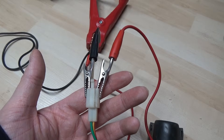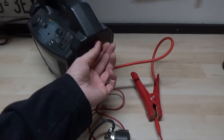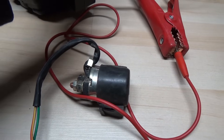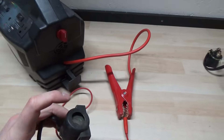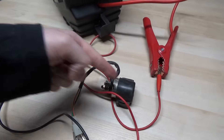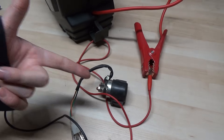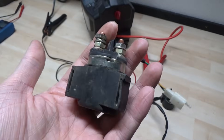I've taken our positive from the battery booster and hooked it up to the red and yellow. We have our old solenoid here — with the leads hooked up, I'm going to flip this switch and you should hear a clicking sound. When I turn this on, you should hear a clicking — and there's no clicking. If I were to leave that in the on position for a few seconds and then turn it off, the bottom of your solenoid should feel warm. Basically what that means is water got in there and corroded the magnet and the shaft, seizing them together. When you supply 12 volts to it, the plate can't move up to connect your two terminals — meaning you can have a good starter and 12 volts on your battery, but as long as the solenoid is seized, your machine won't start. After letting it sit, the bottom of this is a little warm — this one is garbage.